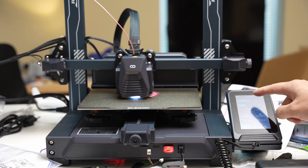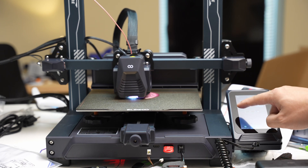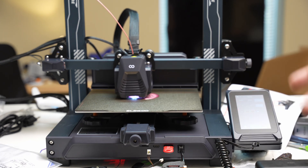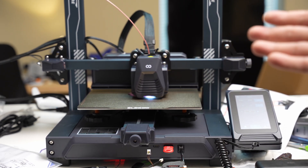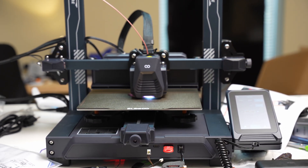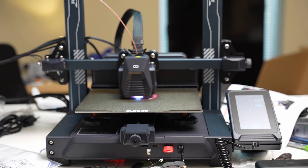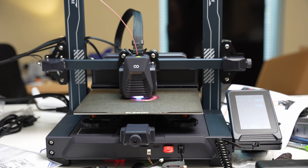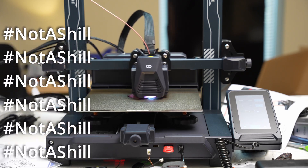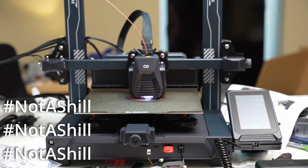I think you can get away with turning the fan speed down a bit. I'm going to turn the fan speed down to 50 percent — this isn't a part with a ton of overhangs so I don't need full fan speed. At arm's length away with 50% fan speed: 48 decibels. So a very quiet, efficient, cheap machine with all sorts of good attributes.